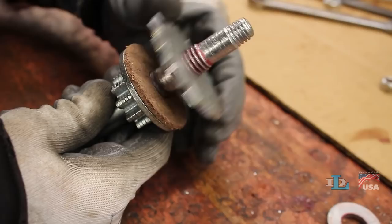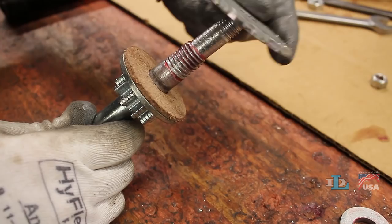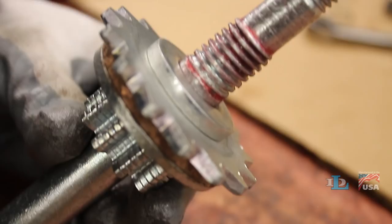Reinstall these parts in the same order on your new driveshaft, making absolutely sure that the ratchet wheel's curved side is set on the pressure plate and its flat side is against the pressure washer, as the assembly must look exactly like this for the winch to function properly.